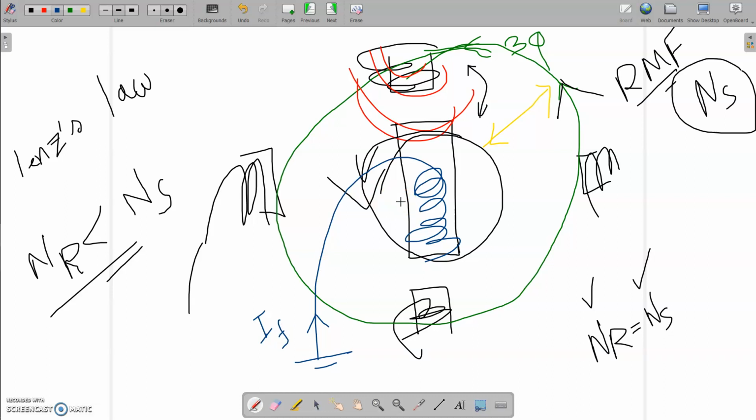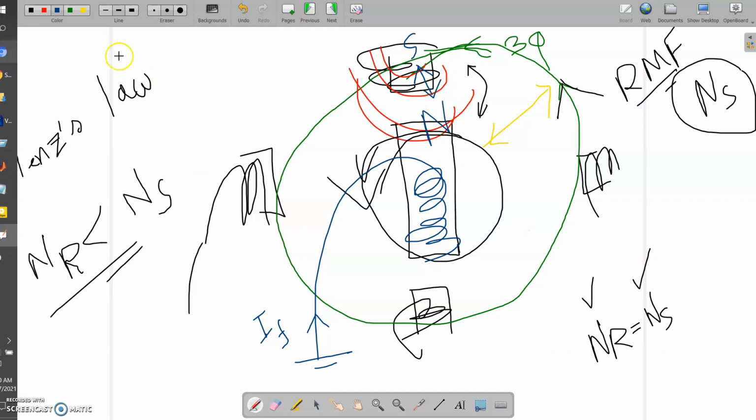This DC excitation, you can think of it this way: once this rotor is rotating very close to synchronous speed, you turn on this power source, and this DC excitation gets energized. It provides some additional force to push it towards the synchronism, just enough so that it reaches the synchronism. Say this is the north pole and this is the south pole. Once they get interlocked, the magnetic south pole and north pole get interlocked, it will keep rotating at the synchronous speed. You just need to push it that far so that they can actually interlock between themselves. Then it will achieve synchronism and keep rotating at that synchronous speed. Okay. So this is the basic procedure to start a synchronous motor.